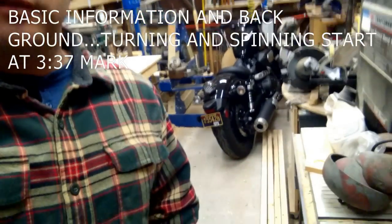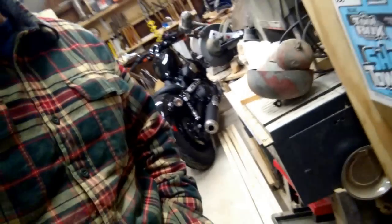I'm going to turn this pile of lumber right there on the floor — these 2x4s — into a mold for the shield. There's a 2x4 on the radial arm getting ready to cut. I'm going to cut these into some blanks and glue them up into a big board on edge, because the Captain America shield is about 3 inches thick. We'll turn it into the shape of the shield with relieves and all, and then we are going to spin some aluminum on it. It'll be my first time spinning — never tried it before. You can see my lathe back there behind the bike with the blue panel, but that lathe does not have a tailstock, so we're going to try something a little unorthodox. I think we can do it — we'll see how it comes out.